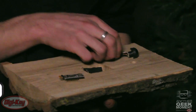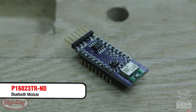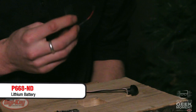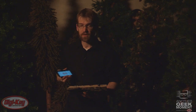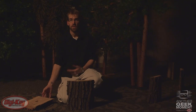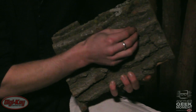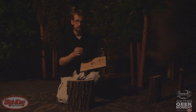The sensors we've created use Panasonic's PIR sensor — passive infrared, 12-meter distance — and Panasonic's Bluetooth module, the Pan1740. They're all powered by a Panasonic CR2032 3-volt lithium battery. To camouflage our sensors, we've taken a portion of a log and honed out a hole for the motion sensor, and created a cavity in the back to hold the Bluetooth module and the battery.